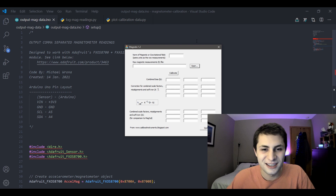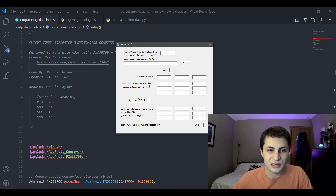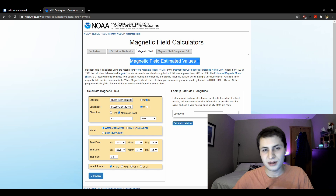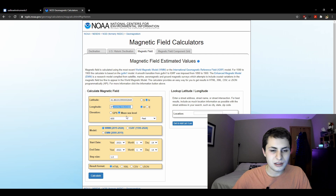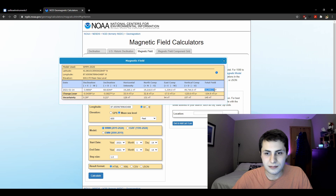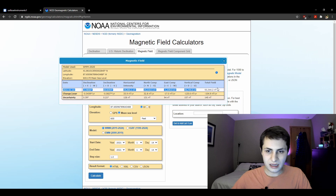When you open Magneto, it asks for the norm of the magnetic field and raw magnetic measurements. The norm of the magnetic field is the field strength at wherever you are in the world. To find that number, use the World Magnetic Model 2020, which I'll link in the description. You input your current latitude, longitude, and elevation above sea level, and click calculate. The number we're looking for is the total field norm — converted to microtesla in my case, that's 53.3, so input 53.3.